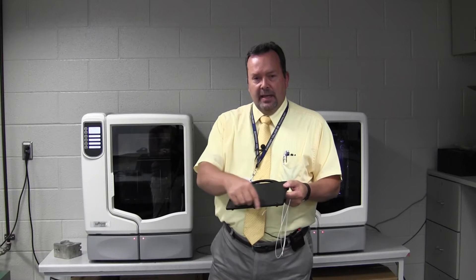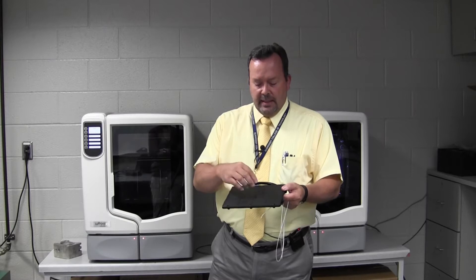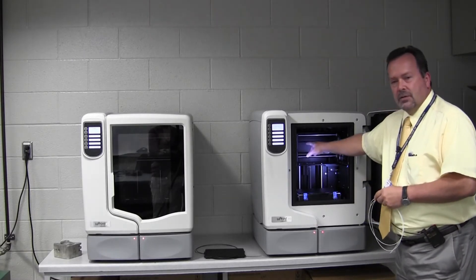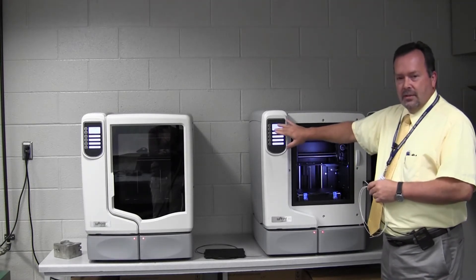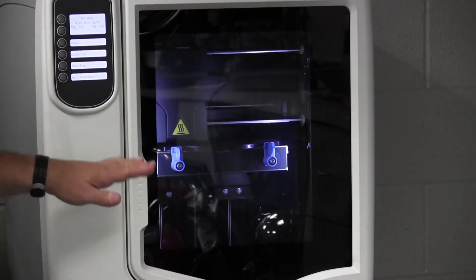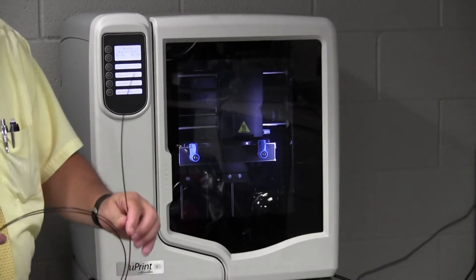This board is the footprint for the size that we have — 6 inches by 8 inches. So the part is traced out on this footprint on this plate and built up until it's finished. That plate is located right here in the printer. The head is a little difficult to see; it's in the back. These are the control buttons that turn the parts on or off. Right now what the machine is doing is laying down the foundational piece of material, which is support material.